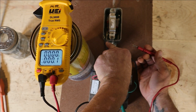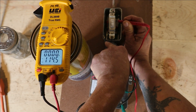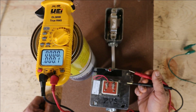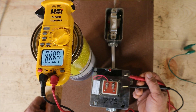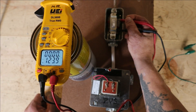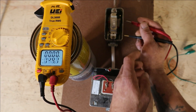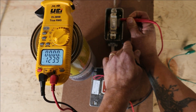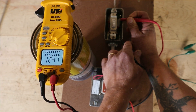I replaced the cord to have a proper ground on it. So I'm going to take one probe and put it on my metal box that is now properly grounded, and the other on the hot terminal coming into the switch — and you can see I'm now reading 124 volts. It's always good practice to verify your readings by using different reference points that should give you the same voltage reading. I'll put my probes on both sides of an open switch — reading 120 volts — and I can verify this using the properly grounded box and the terminal, which also reads 120 volts. Two different reference points, same voltage — my readings are confirmed.